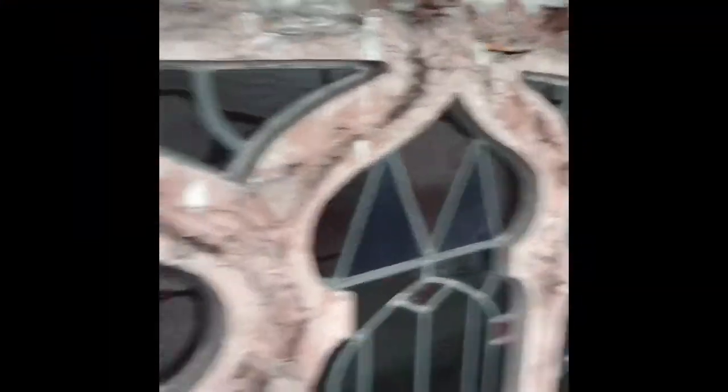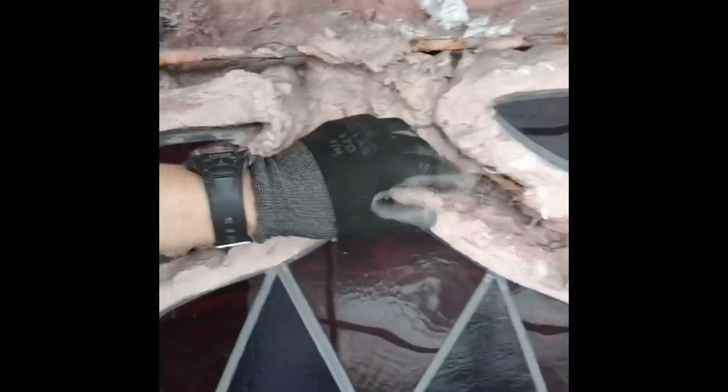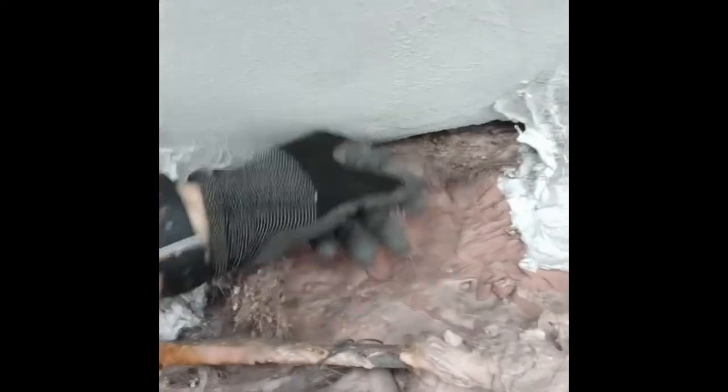The really cool part about this particular stained glass is that it is set in plaster. All these little hairs you see here — this is horsehair, that's how they used to do it. A lot of the other stuff is set in stone, which will be very difficult to remove. But we're excited to find this bit in plaster so we can actually chisel it away, and I'll show you on the other side how cool this stained glass is.